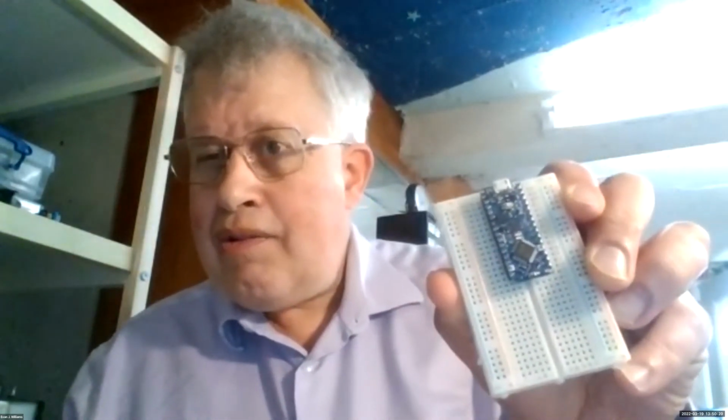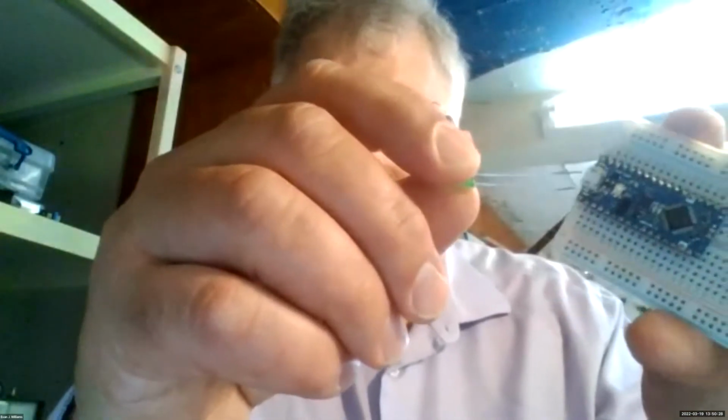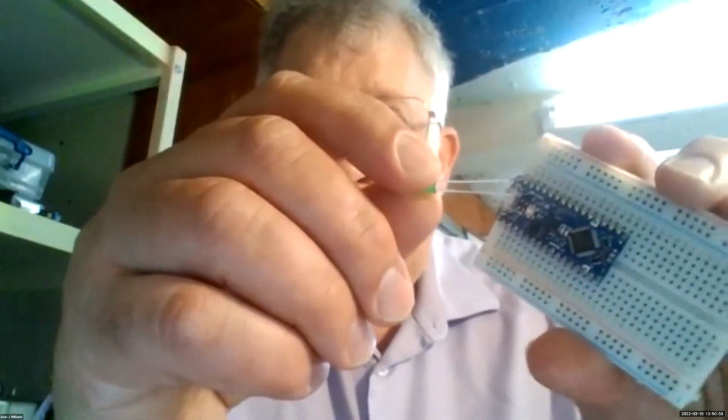So I have a light emitting diode here, and you have to carefully look up which side is the anode and which side is the cathode so that you don't reverse bias it. In other words, the cathode, or maybe you could correct me on this, is wired to ground, and then I have to see what pin we were using.